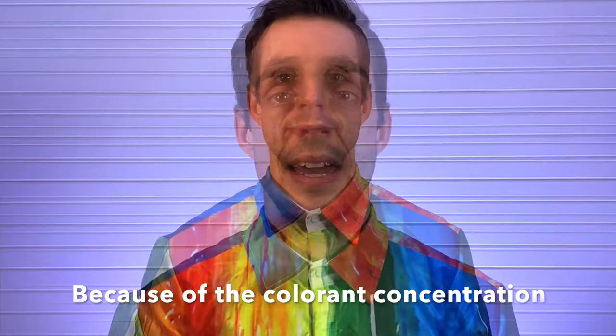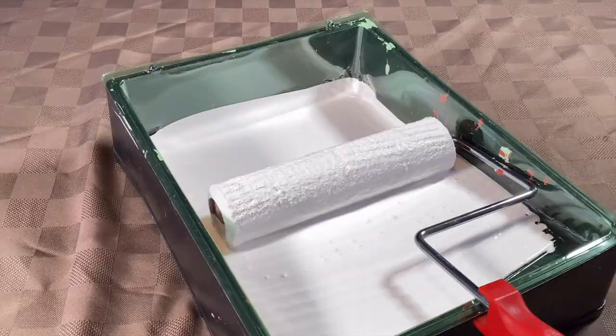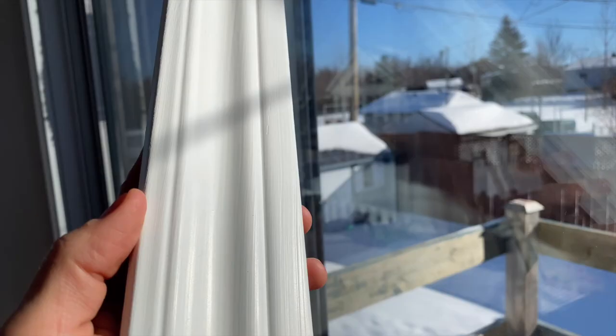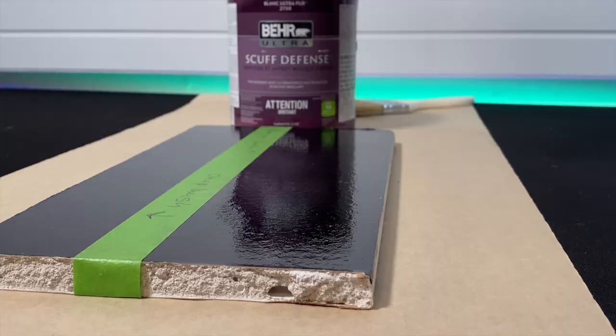So let's go to the cons. There's really not a lot honestly, but first let's talk about the sheen. This eggshell finish has too much gloss for my taste — it's not a problem in itself, it's more a personal preference, and it's probably even glossier with a darker color. I will test that out soon, so make sure to subscribe and push the bell notification. Second, the leveling capabilities. Although it's not bad at all, to be frank, it doesn't level out perfectly with a brush and the orange peel is kind of high. A different roller could do better, as could applying a thinner coat. I wouldn't recommend it for door or trim work too — maybe the satin or semi-gloss finish is better for that. That said, for your cuts, with a proper technique and a premium brush, you shouldn't get any brush marks when cutting your edges.